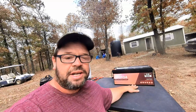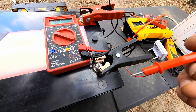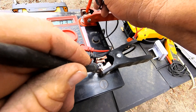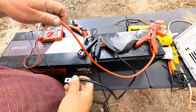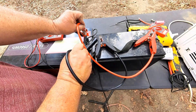I'd be interested in testing a refrigerator or even a TV and internet. We're not getting any volts off this battery now. When you run one of these lithium batteries down to a certain point, the battery management system shuts the battery completely off. Here's another 12 volt battery — we're basically going to run the positive to the positive and the negative to the negative. That'll wake the BMS up so we can get the battery charger back on it.